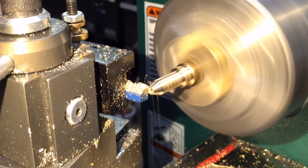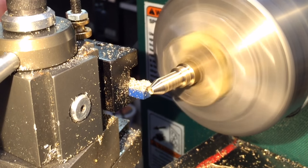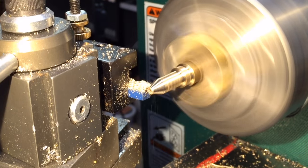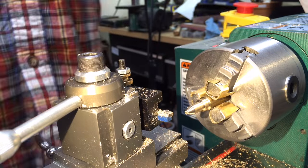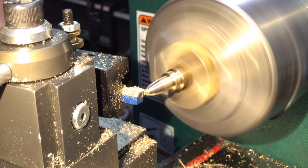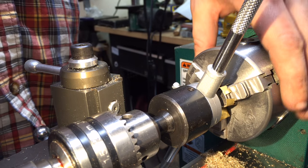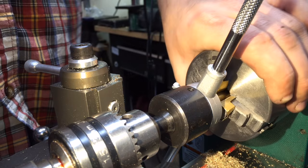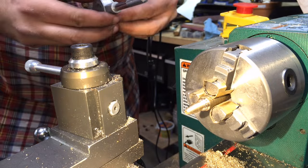This is actually very easy and rewarding compared to turning stainless steel — you may have seen me doing the suppressor baffles. This took no effort to make this little conical cut right here. I'm actually doing two angles on this cone — the first one is about 30 degrees and this one is either 20 or 15. It's just an aesthetic thing, but you can see this one's a lot more shallow and straight. Those two angles kind of make it almost seem like a subtle curve. And then we're just going to use a die — this cuts threads on the outside. I happen to have the die, and it's basically just as easy to use as the lathe thread cutting method.